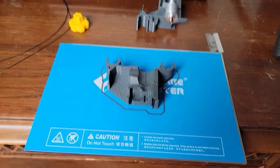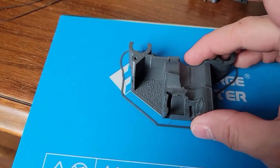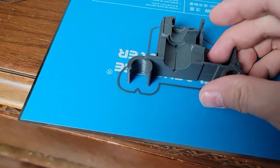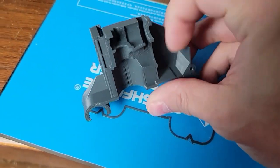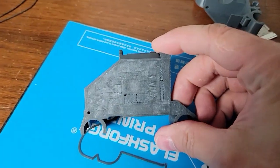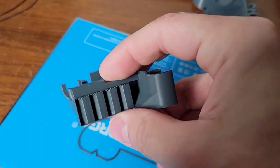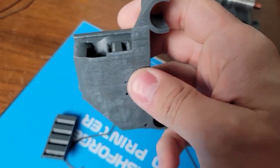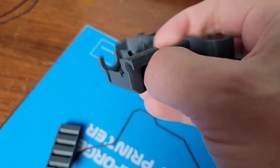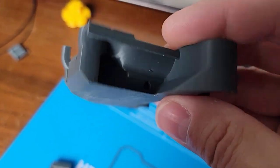It's still hot. This texture here — the top layer looks quite over-extruded, not sure why. Otherwise the print looks fairly good, maybe a bit too much squish. But look at these supports — this is ABS — absolutely amazing one-handed support removal. That came out perfectly. I didn't even ask for supports in there.